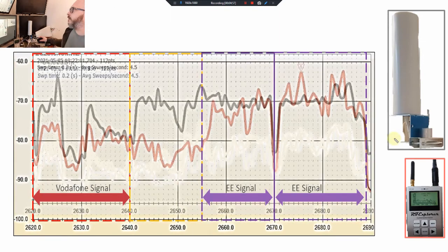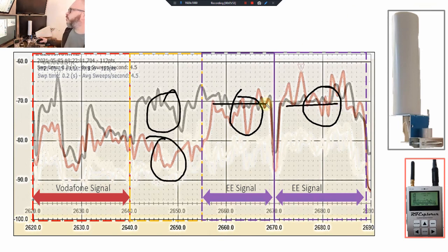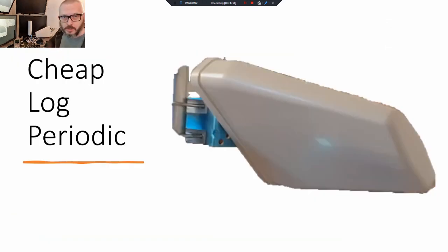On to the high band, and we can see that the black and red traces are pretty much overlaid on top of each other - in other words it provides no gain at all. When averaged across the whole band the antenna gain is about 4 dBi, but because of the cable, as a whole product it works out to about a 6 dBi loss compared with the stub antenna of the spectrum analyzer. Again, a really poor result. So the antenna is a bag of bones really.